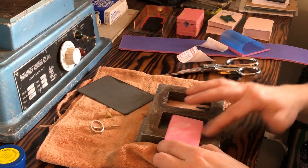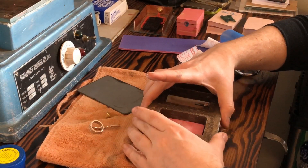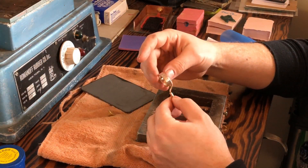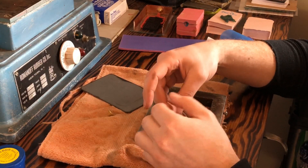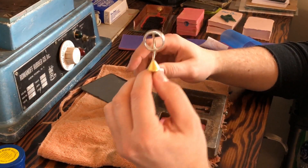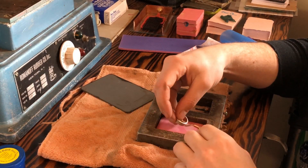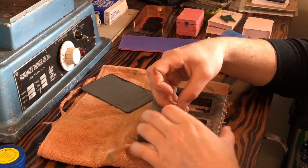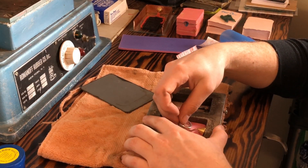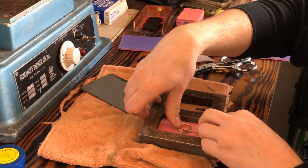This is the bottom layer of the mold sandwich, and this is what the bronze sprue rod is going to sink into. You can see that little bend — that's going to go into the cream side, which means I won't have to do any cutting whatsoever. It'll fold over as it expands in the vulcanizer and become free automatically. I've slipped the model into the cone, which creates the shape of the nozzle for the wax injector, keeping everything airtight when the molten wax is injected.